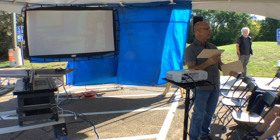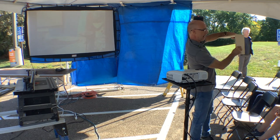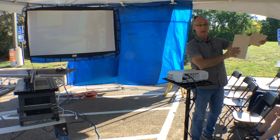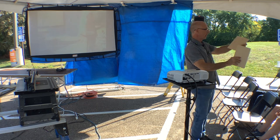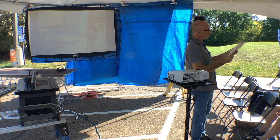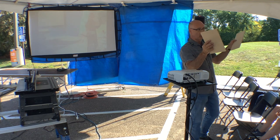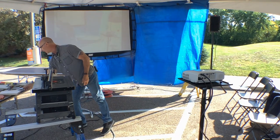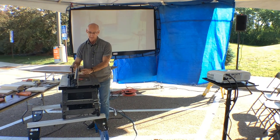This is the same approach I take when I make cabinet carcasses. I overcut that rabbet at the top of the cabinet, and then I flush trim it after the fact. So then it looks to everybody else like you made it perfect. But you made your woodworking life easier by cheating just a little bit. So one of the things we know, Baltic birch plywood, it's a funny dimension. It's 12 millimeters, which isn't a half inch. So even though I love my bar stock, this is not a good application for bar stock.